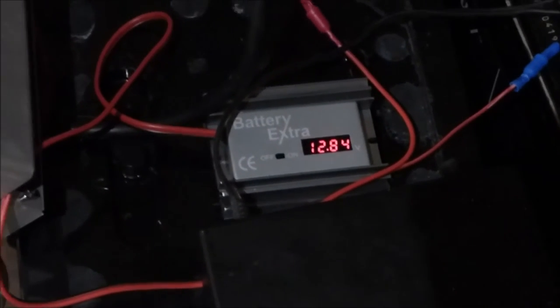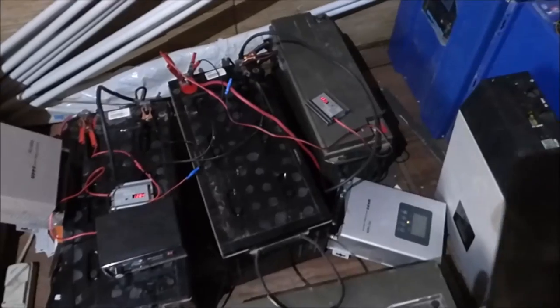Today we have new candidates — new, almost-dead victims. One seems to be doing okay at 12.84 volts, maintaining that reading on the battery desulfator. This other one is a struggle — it dropped all the way to 8.01 volts, a number you should never see on a battery. We've been charging and discharging it, using the charge controller as a small load. Once the voltage stabilizes — the battery desulfator now reads 12.99 volts — we'll put it on an inverter and run an electric drill on it. This will take a few days, but we'll get it done.